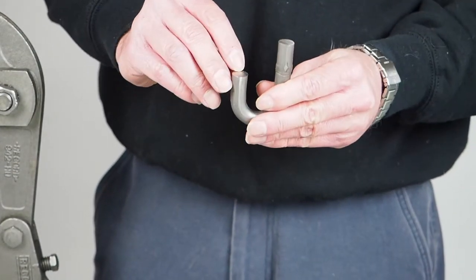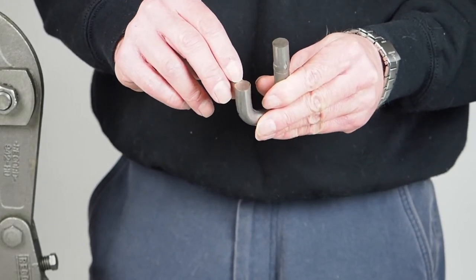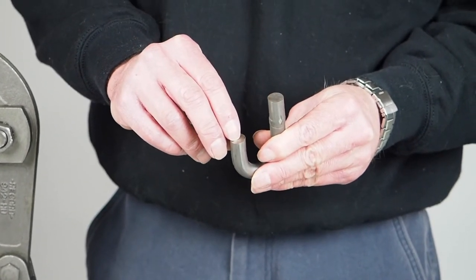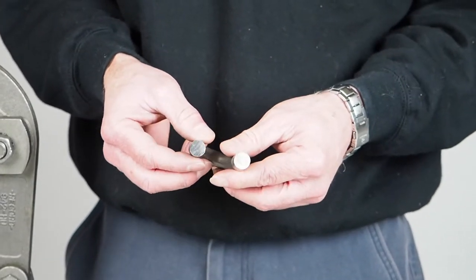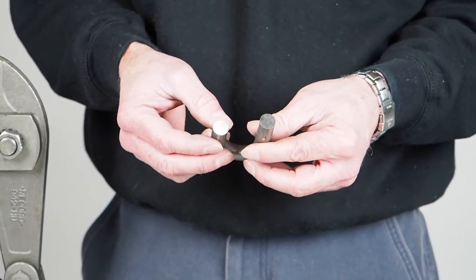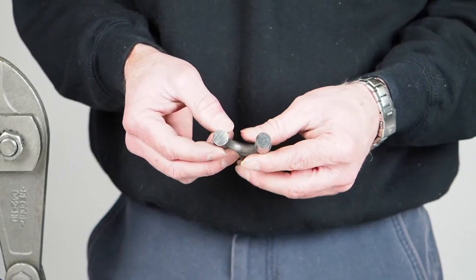Also across the cross section, the laboratory will do a series of tests to determine how that hardness varies as you go towards the middle of the cross section, towards the middle of the chain. Now case hardening gives increased hardness on the surface, but it is softer inside that hard skin. It'll stop hacksaws, but it won't be much good in other respects.